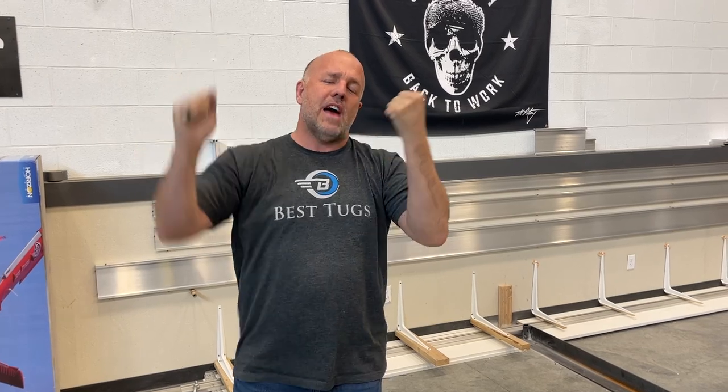On an actual aircraft, you build an entire wing for the FAA, load it up with bags, and that load is evenly distributed. And that allows the spar to go much further. But the fulcrum snapping point is still at the strut. If you hit a heavy bump, that's where the heavy load is, and that's where it will break. But in flight, it's even load.